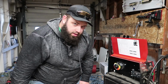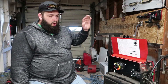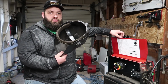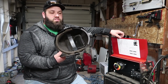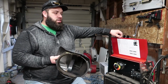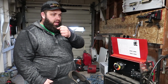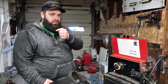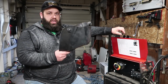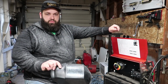My biggest recommendation, if you buy this kit, while you're at the store and you buy this machine, buy one of these too. Buy a real welding hood. These are like 25 bucks, okay? Buy a real welding hood. You will thank yourself, because trying to hold a steady weld and a shield in front of your face is near impossible. It's not any fun, it sucks. Buy a good hood, and buy extra plastics and extra lenses for it too.